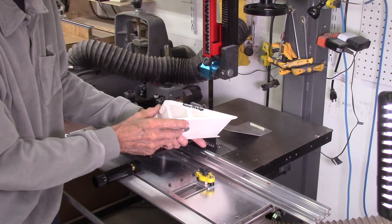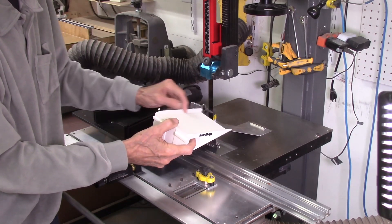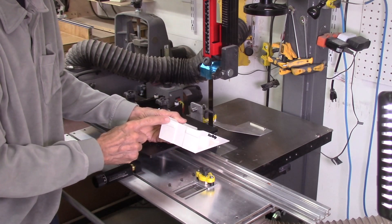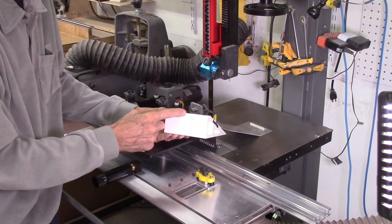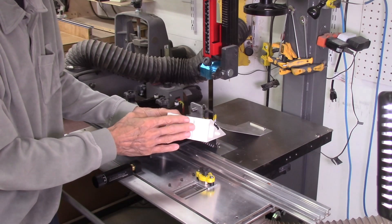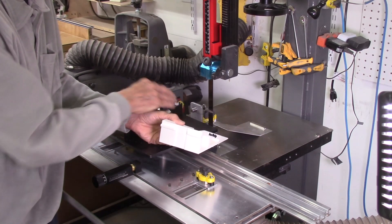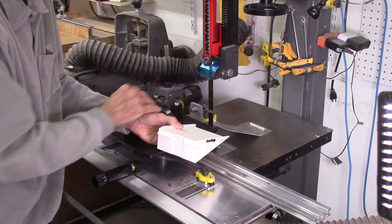I have put the name on the side. The Fusion 360 software has these ramps on the side and these clips that go underneath the accu-wedge table. It has this cutout here for the bandsaw blade, so I get my bandsaw blade really close to the accu-wedge table and eliminate the possibility of boards getting jammed in the gap between the ramp and the accu-wedge table.